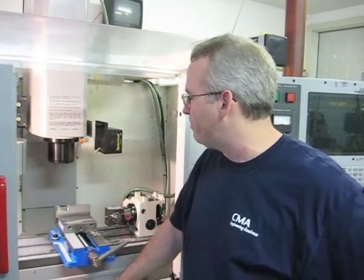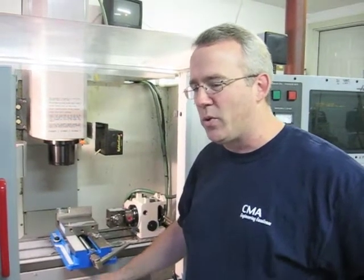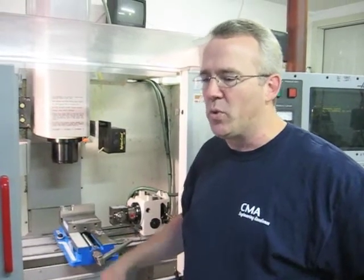Hi, I'm Dave Ray from Ray Industries. A few years ago I bought a Haas Mini Mill with standard flexible lock lines for delivering the coolant to the cutting tool. I used those for a few years, and when the coolant isn't correctly at the tool — if the lines move — chips can gall up on the tools and break, and it can get pretty costly.